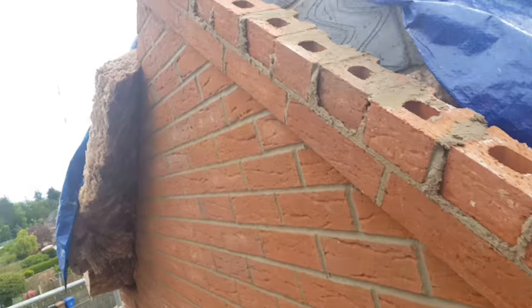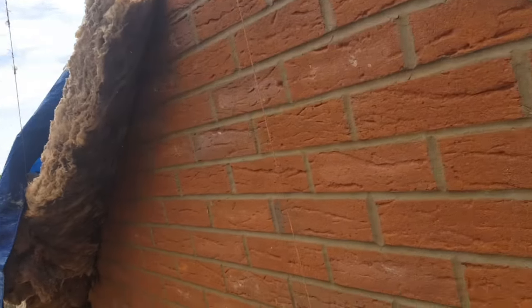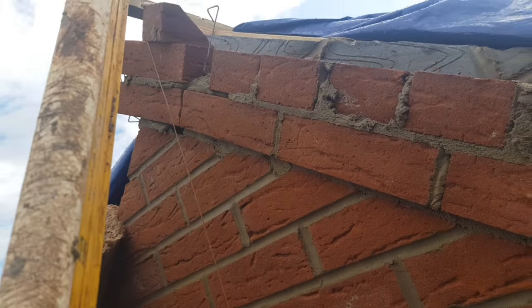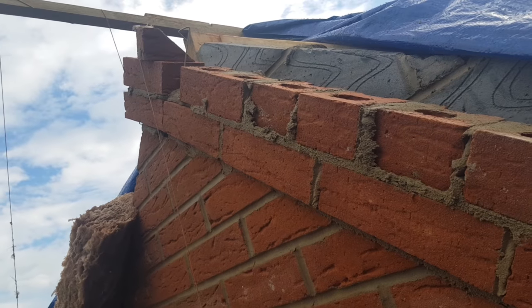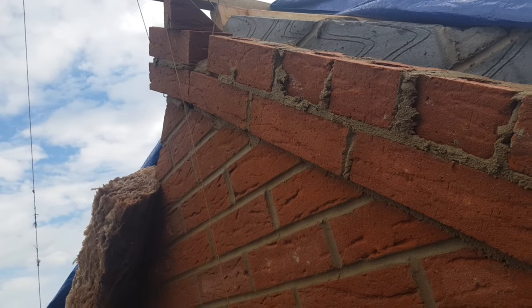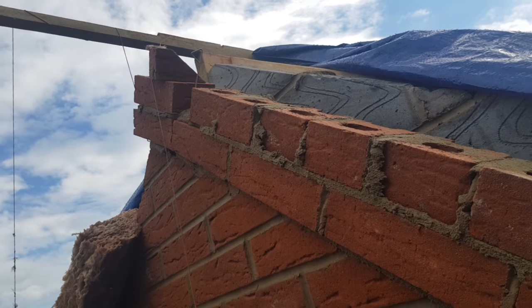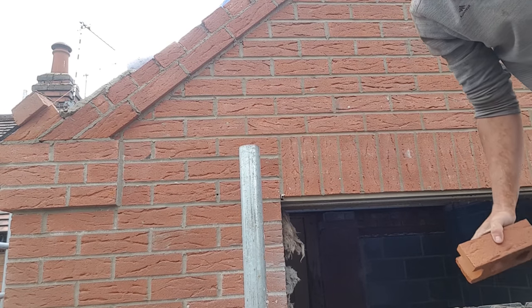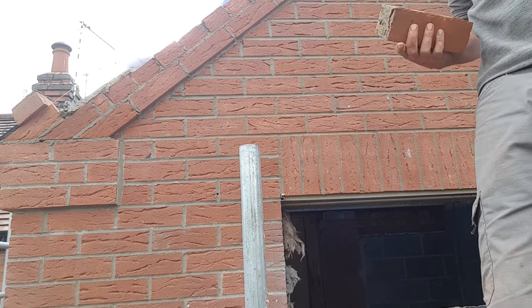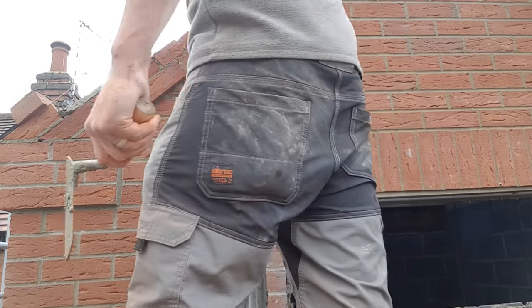Well, I just put another dead man at the top, I don't know if you can see. And then once I've done the cut up and everything on that side, I take all my dead men off and then finish the last bit freehand with the level. Easiest way I found, unless someone's got a better way. Probably a profile, but fuck it. Yes! That should work.